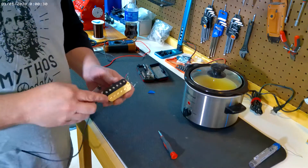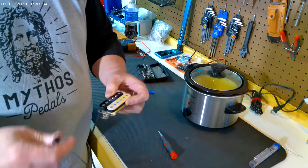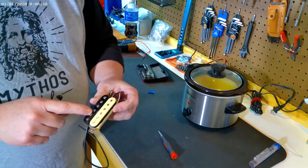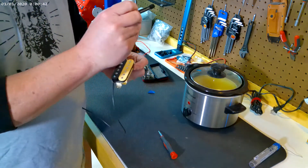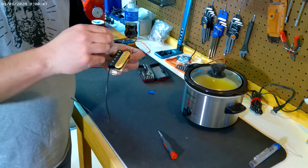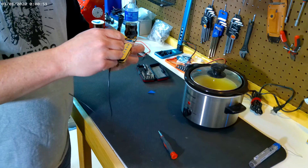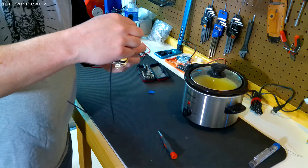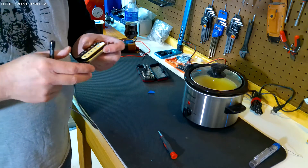Sorry about that, my other camera died. What I was talking about was the magnet - along the long edge is where you measure your north and south polarity. I want the screw side to be south and the slugs to be north. I have this tester, and when I put it on there it's got a little ball in it that will flip. When I go to the screw side it comes up black - black means south. When I put it on the slug side it flips over to white, and the white side is the north side. So that's exactly what I want it to be.